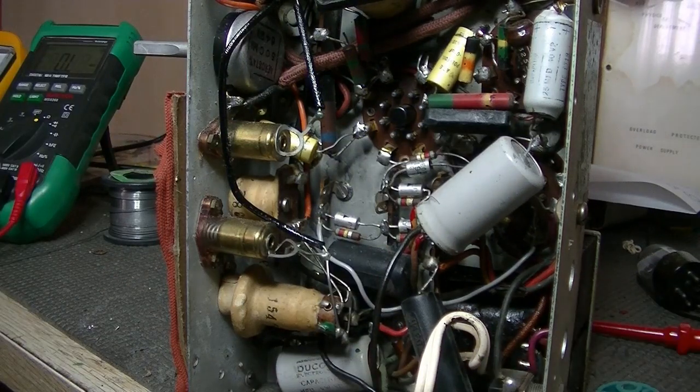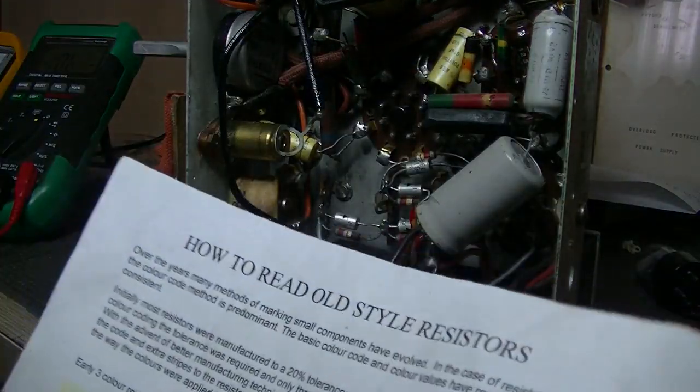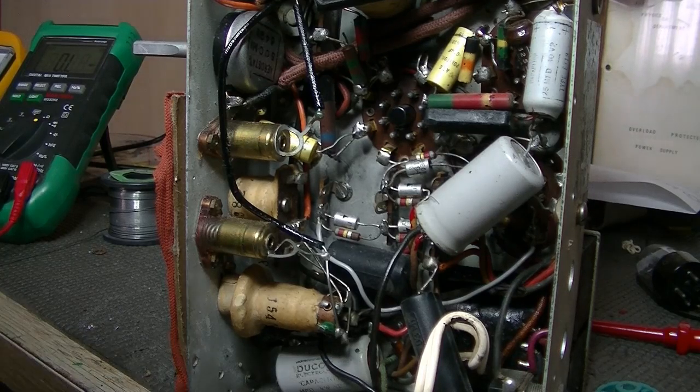Anyway. So I've had one radio where it had half-wave rectification. That's going back a few radios now. And that was fairly straightforward. I just had to take out those two diodes and put a valve in. As far as I remember, it just worked. And this one, he's got each diode strapped with a grey, red, and yellow, according to my chart, 820K resistors. So I've not seen a diode rectifier set up with resistors. But anyway, I'm not an expert on them by any means.